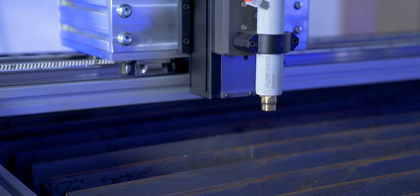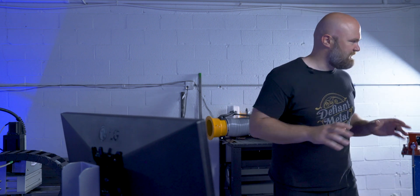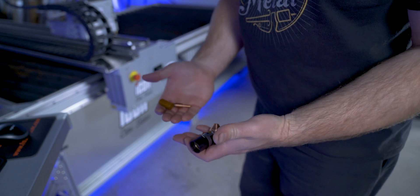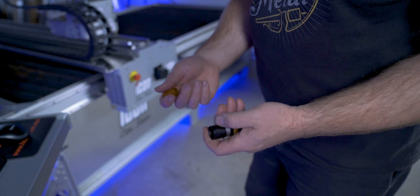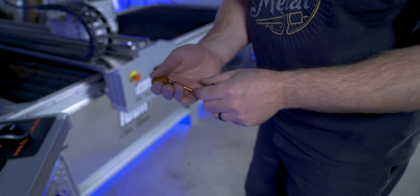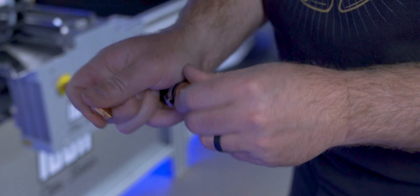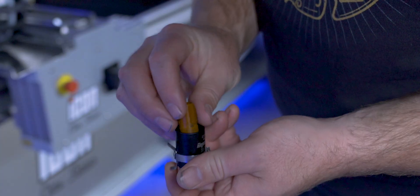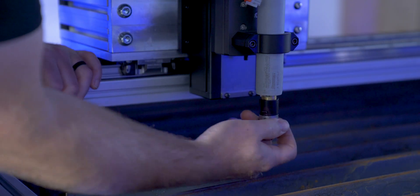I just don't really know what I'm supposed to do now. How about we start with some consumables on the torch — those threads are easily damaged. I saw a kit for that. Is this right? Can you explain what I need to do? This is a little different than a TIG machine. Connect the shield to the retaining cap, then put in the nozzle, followed by the electrode and swirl ring. The swirl ring should slide over the back of the electrode, just like this.